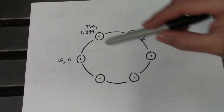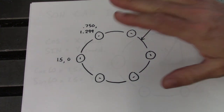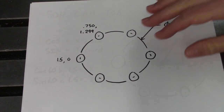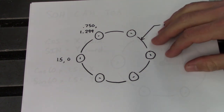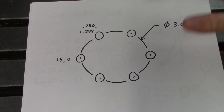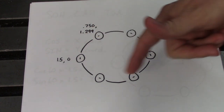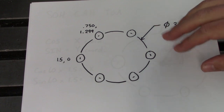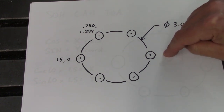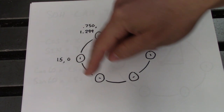All four of these holes are going to be the exact same coordinates, with the only difference being whether they are positive or negative numbers on the DRO. You can use CAD to figure all of this out if that is available to you, but honestly, where is the fun in that? There are also numerous bolt circle calculators you can find on the internet or in machinist apps for your mobile device. With those, you can input your circle diameter, the number of holes, and the starting angle, and the calculator will give you your numbers. Starting angles follow CAD conventions — 0 degrees is at the 3 o'clock position, 90 is at 12 o'clock, and it proceeds around the circle counterclockwise from there.